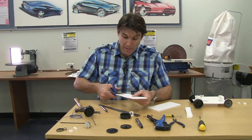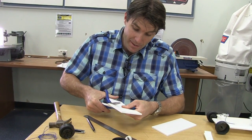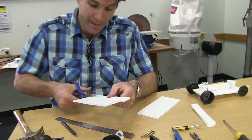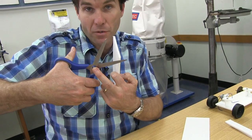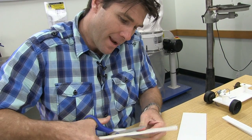The better your scissors, the easier it will be to make that cut — it's not going to be easy. Cut halfway on one side, then turn it around and cut again from the other side. When cutting, you need to get your scissors right up to the rotation point, called the fulcrum. Push it right up to the fulcrum to make that cut.